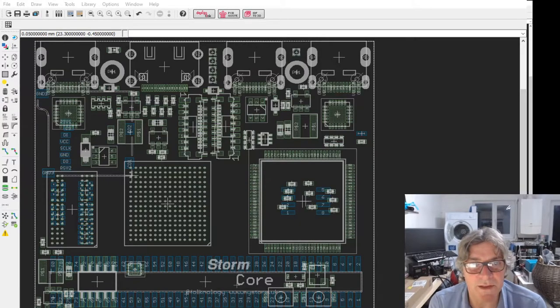Also, the other difference between the STM32 H7 and F7 is the H7 has about a megabyte of SRAM in banks, whereas the F7 probably only has about 380 something. It also has half the internal flash that the 400 meg version has as well.